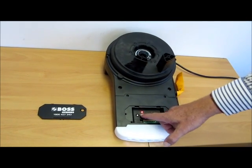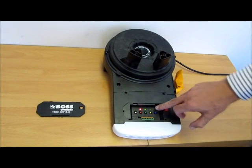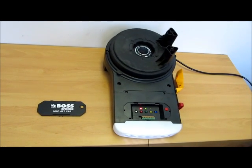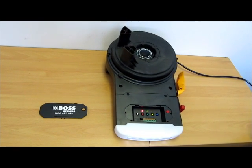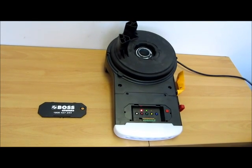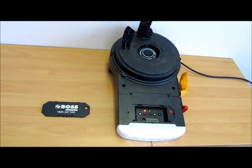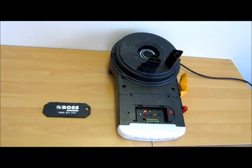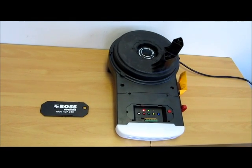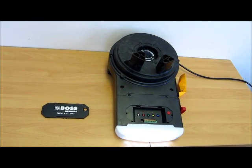In this case we'll say that's your down position. Once we're happy with that, press the limit button once and it is now set. We now need to set the force, so we press the blue button. That will automatically drive to the up position, stop for about a second to a second and a half, and then drive back to the ground. Once it's complete, it will beep three times, and you've set the limits and the up force.